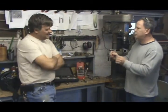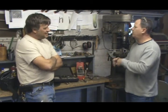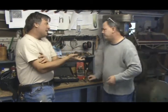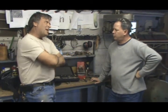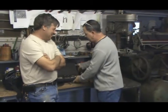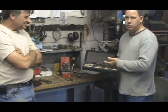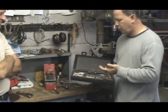I'm looking for a tap drill of half-thirteen. Seven-sixteenths, twenty — whatever you've got to use. Now, like here I don't have the internet. Is there some way I can cheat? Sure, you probably have a smartphone. But that being said, in most of these tap sets that you've got, you'll have an actual tap chart that comes with it. Utilize those — they work out really well.